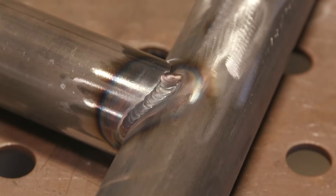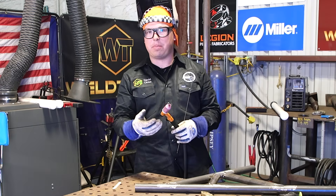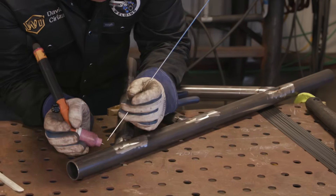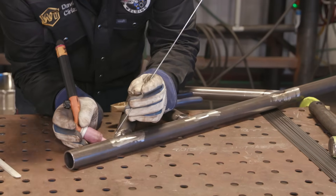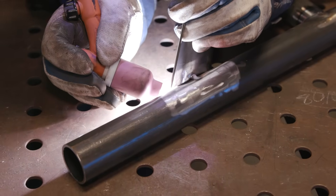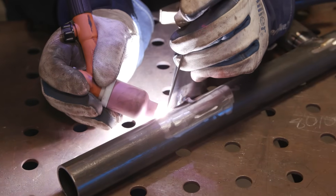I'm going to throttle down and readjust myself. In some places where you don't need all that tungsten stick out, go ahead and bring it back in — it just helps keep a little more control. I'm going to use these pliers kind of like an armrest to help keep my wrist and arms off the hot surfaces. Again, warm up the tacks. Takes some practice getting around all the tight turns and weird angles, but as long as you don't run too hot, it gives you enough time to readjust. Use that foot pedal to your advantage.